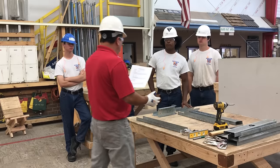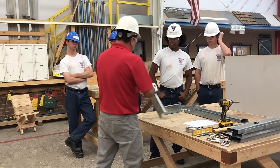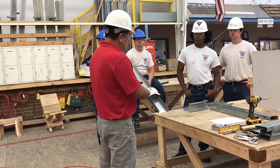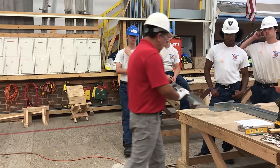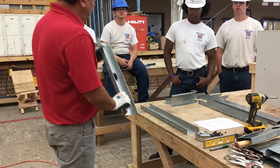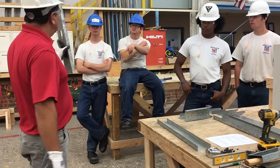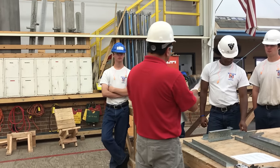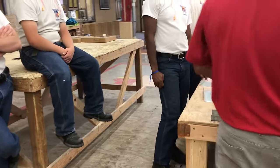I'm going to demonstrate the materials we need. There's a difference. This one is called a track — it's a three and five-eighths metal stud track, three and five-eighths on the back side, with a flange of about an inch and a quarter. This is our track, our guide. And then we have our metal studs — they've been pre-cut. How do we distinguish the track from the stud? The stud will always have a hole in it, and I'm going to show you why that hole is needed.